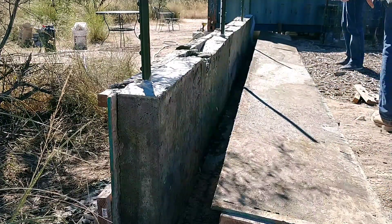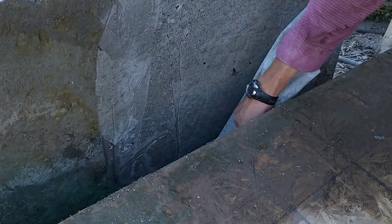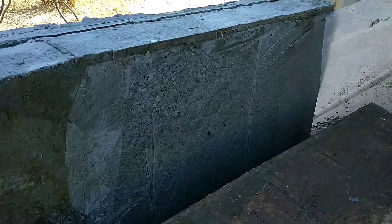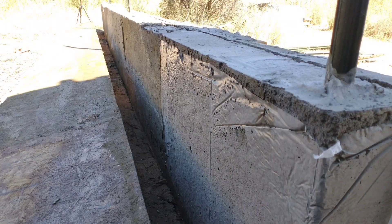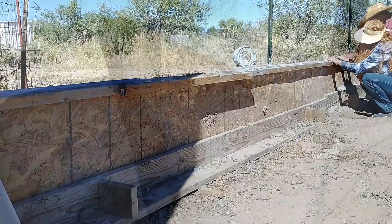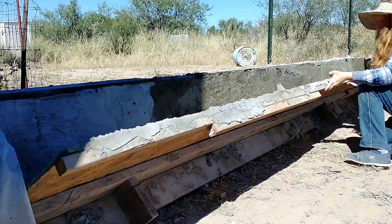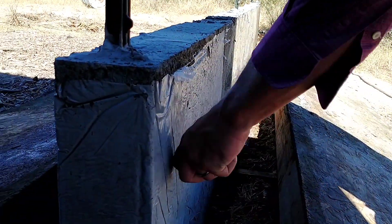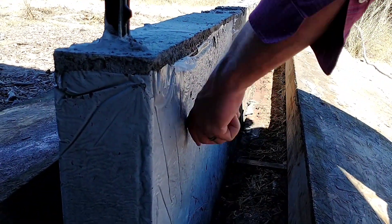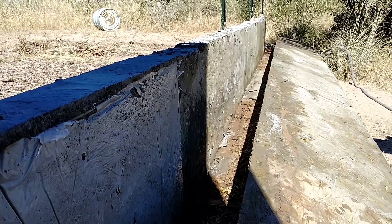As soon as we took down this first portion of the wall, we were quite impressed with how it looked. You could definitely see where some of the cold seams were — where you pour one mix onto another — but honestly it didn't look like there was a separation. They seemed to combine and form into one mass pretty well. There were a few little unexpected issues, though — one was a little seam of sand we saw in the wall.